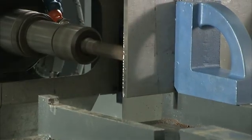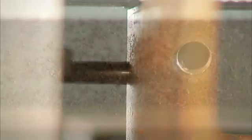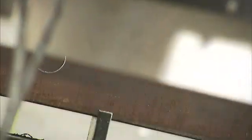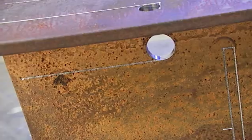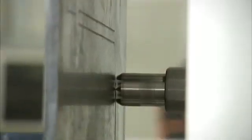The Excalibur 12 provides coolant through the spindle for typical drilling operations, plus an external atomized spray mist coolant for such operations as tapping, counter-sinking, and milling. When slotted holes are required, the sub-X axis is used to quickly mill slots as required. The scribing option can be selected to generate piece part marking on any of the four surfaces of the section. The detail location and part number can be scribed to eliminate manual layout for subsequent fitting. The main section and detail parts can be scribed on the Excalibur 12 to make the fit-up as easy as matching part numbers and orientations.